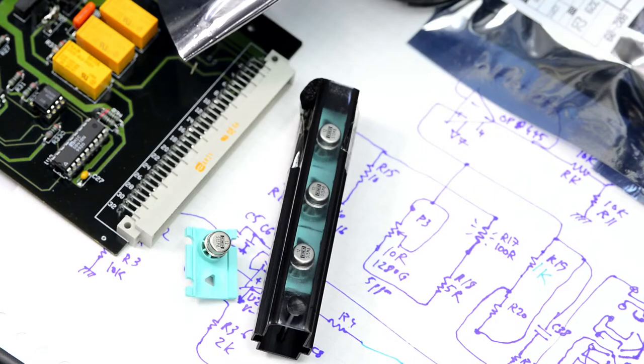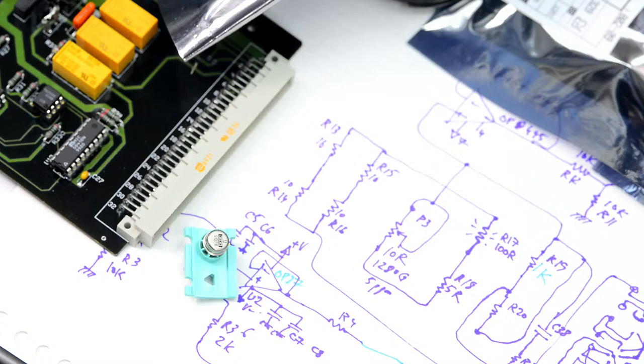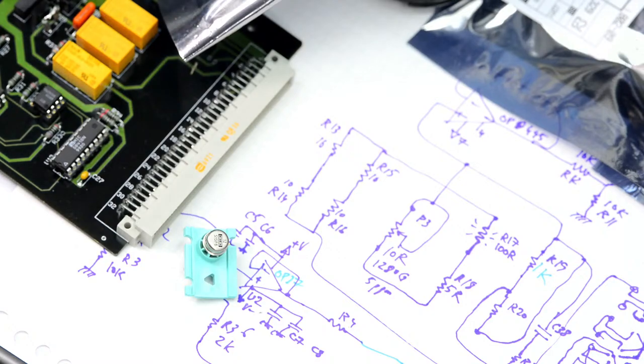I'm happy that it's not an obsoleted part, as usually happens with these hermetic packages. And actually the price is within reasonable limits, because you can buy an opamp in a normal DIP epoxy package for maybe $5 for a really good opamp, and if you go to the space qualified hermetic packaging of the same opamp, it would cost like $100, so $15 for this one is not that bad.